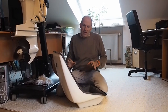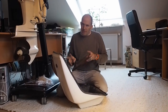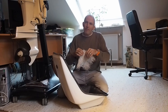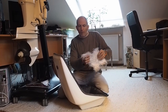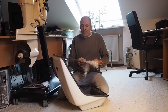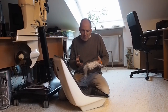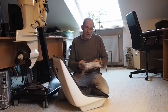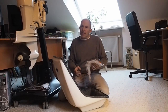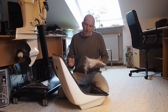Every single GT160 I've seen so far was missing these seat shells, and if I saw some they were all cracked. The main reason is that they were made from fiberglass net like this, which is fiberglass reinforcing the resin, but the resin-to-fiberglass ratio is not really good — basically too much resin for the amount of fiber. The fiber itself doesn't give much strength, and they used very little of it, so all the original ones were very brittle and had cracks all over the place.